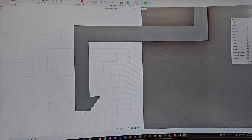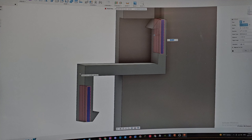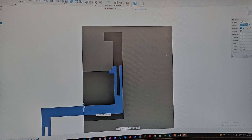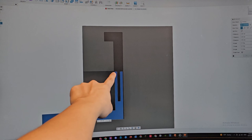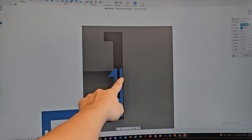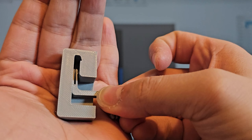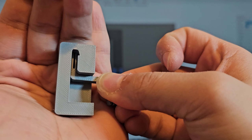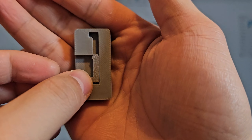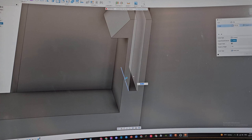Now I make a triangle on both sides. I cut that, and if we move this thing up — it's not perfect in Fusion 360 — but you can see the point colliding with the triangle below. In reality, that triangle will fold backward, clear the 1 mm gap from point to point, and then click into place just like I showed earlier. It moves backward and then clicks — that's so satisfying! Without the middle cut, there's not enough space and it won't go up.